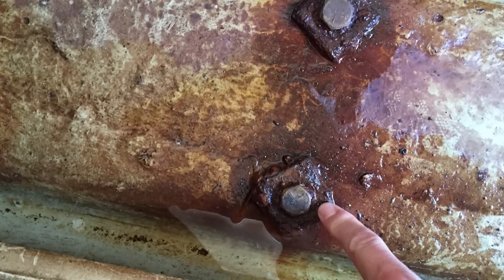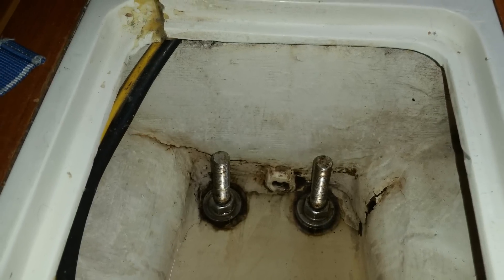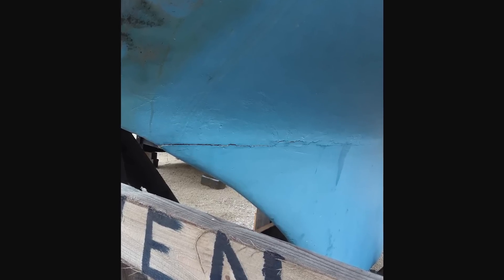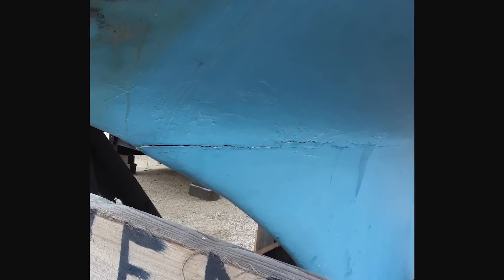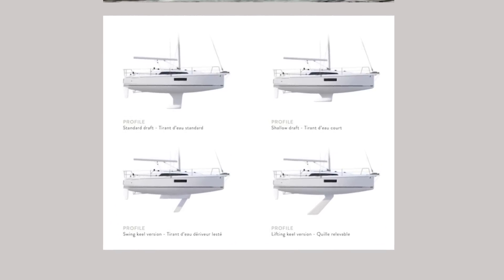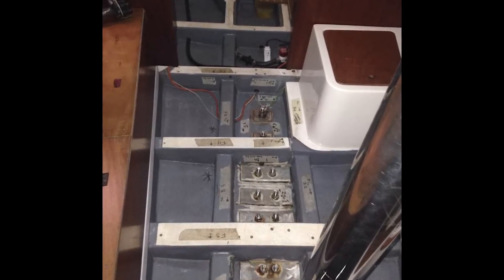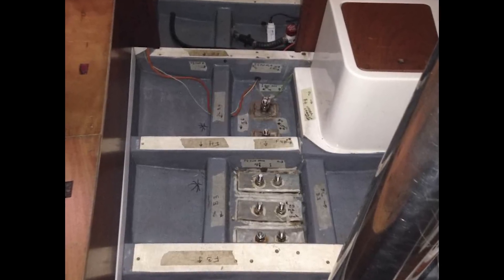In the bilge we're looking for rusty bolts, ovalled keel bolt holes, stress cracks in the glasswork around the bolts, and delamination of that glasswork. Outside we're looking at the keel-to-hull joint for that famous crack, usually at the forward edge. Have your surveyor pay special attention to the keel bolts and the keel-to-hull joint. Beyond that, making a good boat choice is paramount. So many people buy that Catalina 42 Mark II because it's not known to have keel failures from groundings, and it owes that to good design. If you're looking at a super high-performance, high-aspect keel with a tiny mating surface to the hull like that Beneteau 40.7, we have to be extremely suspect of that stringer keel matrix inside the hull — it's been known to delaminate, and in extreme cases rip right through the bottom of the boat, keel and all.